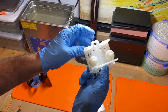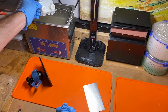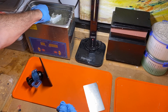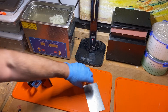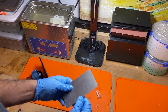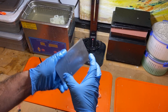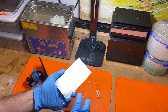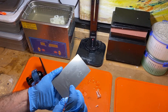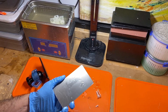I'll be pulling off these supports with a little bit of cure and dropping them in my ultrasonic with Monocure's resin rinse. It's also possible, of course, to drop your whole flexi plate with the printed part on it into your bath for washing and even cure on it if you like. I'll do that sometimes when I have some very fine and delicate parts that I don't want to warp.